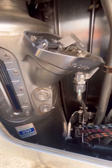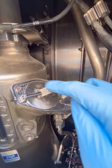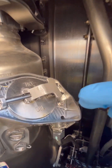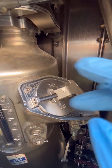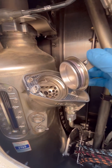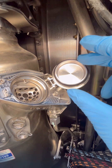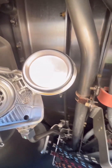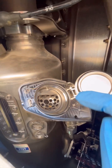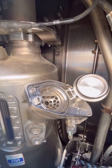Let's open up the oil can and start servicing. Before opening the oil filler cap, we need to do an inspection around the area to make sure there is no debris or FOD that could go inside the oil tank once we open the oil cap. We open the oil cap and do an inspection of the oil cap seal to make sure it is in correct condition to avoid any leaks. We also take a look inside and around just to make sure everything is okay.